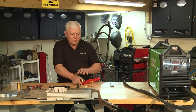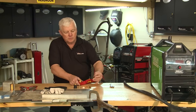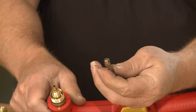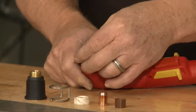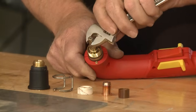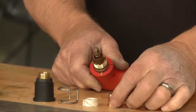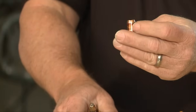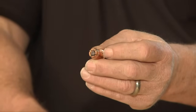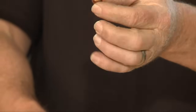I've taken this torch completely apart. I'm going to show you the components that wear out the most, or first. This particular component is like a contact tip — it'll actually wear out at the very end and you'll have to replace it periodically, so slide it into place with just a slight tighten, with the insulator in place. Now this component right here is the one that really determines how sharp of a cut you get. If you look real close, right in the center there's a hole, and it'll eventually start wallowing out and your cut will get wider and wider. You have to decide when to change it, but that's the number one consumable.